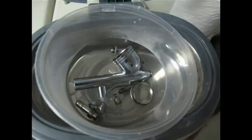Once it was all dried down, I quite heavily greased the inner part, the spring, the bit where the needle goes into the paint chamber, the air solenoid, the trigger, everything, due to its ability to leak paint due to one of the washers just dying in thinner.